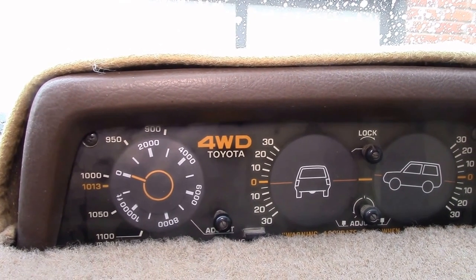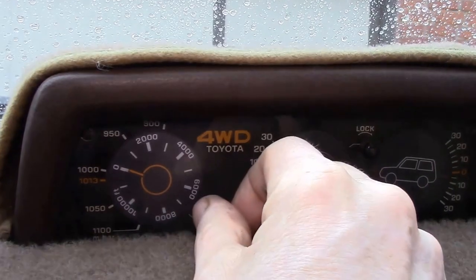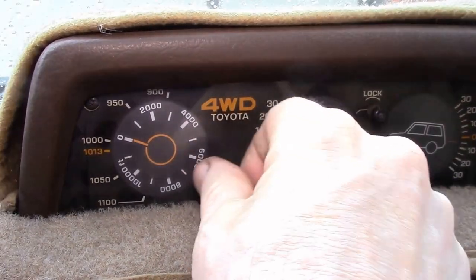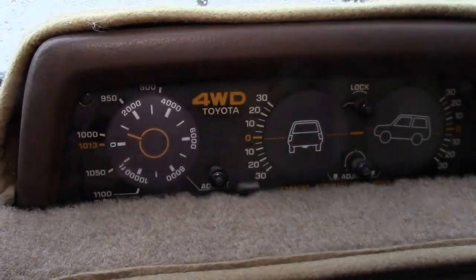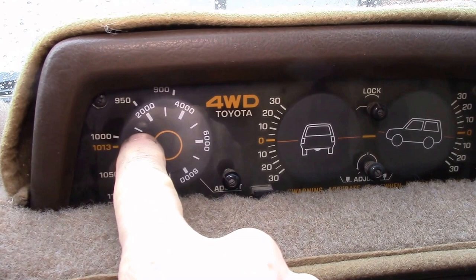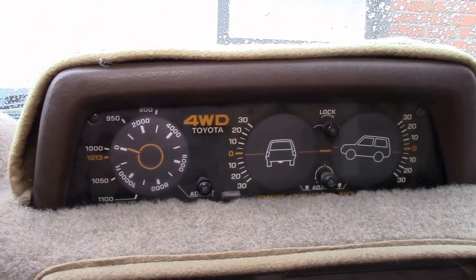You can read the altitude pretty easily, but you can also do it the other way — if you don't know your elevation but you do know the barometric pressure, you can set the zero at normal pressure. For instance, if I set the zero over to 1013, then the elevation would read correctly.